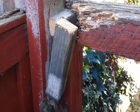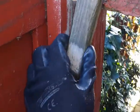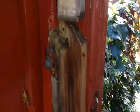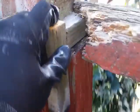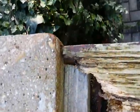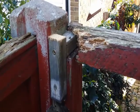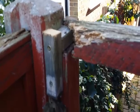We've driven some extra pieces of wood here to block this bit off and drive it all in together on this side so it doesn't come off again. We've taken a piece of wood, cut it, and placed it in this position here, just above where the lock is. Then you've got another piece driving on top where it was rotten, and we're going to situate another piece behind there so the two pieces lock together, and we'll drive a long screw all the way through the middle so it is secure.